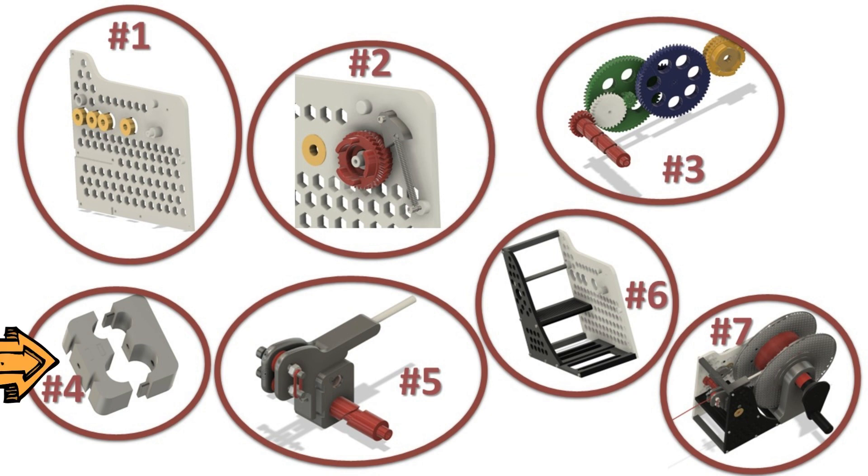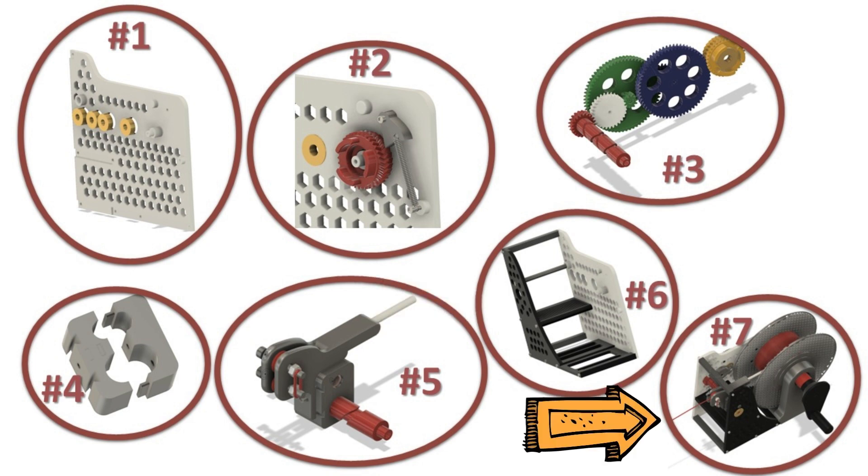In the next section, we assemble the most important part for the filament guide, the so-called rider. It is firmly mounted on the spiral shaft. The actual filament guide is slid into the dovetail groove of the rider and adjusted. Once the gearbox and the filament guide have been installed, the housing can be assembled. In the last section, I describe the assembly of the coil holder, the assembly of the coil, and finally the final assembly.